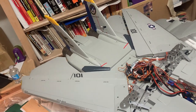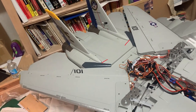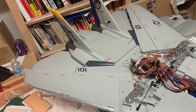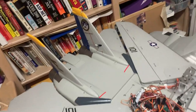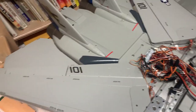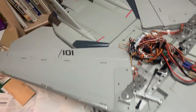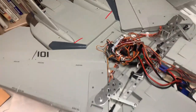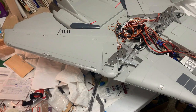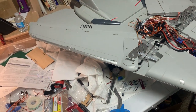In addition to wing sweep, that setup had the ability to automatically bring the flaps up immediately before the wings started sweeping. That's important because if the flaps are down when you sweep the wings back, it probably won't be good for the flaps — you might get some damage. Anyway, today we're going through the controls configuration as it comes from Free Wing.